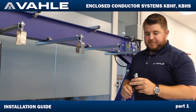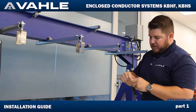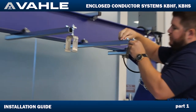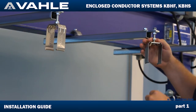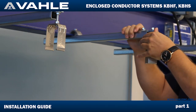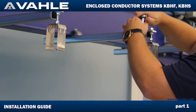Next, we're going to take our fixed point hanger. Go ahead and take off this top nut, take off the crush washer, and the flat washer. Put it up in here — flat washer on first, then crush washer. Push this flat washer that's on this hanger all the way against here and go ahead and tighten down this bolt to keep it from moving back and forth.